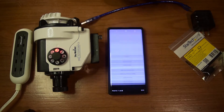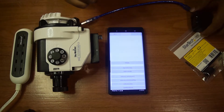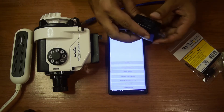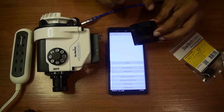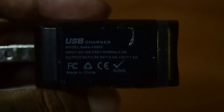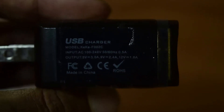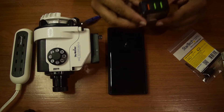Now let's close this and power it up using one of these mobile adapters, which are 5 volt. The adapter I have has three USB outputs. At 5 volt it generates 3 amperes; at 9 volt it generates 2.4 amperes; and at 12 volt it generates 1.8 amperes. Let's see how it looks when we power it up using this.